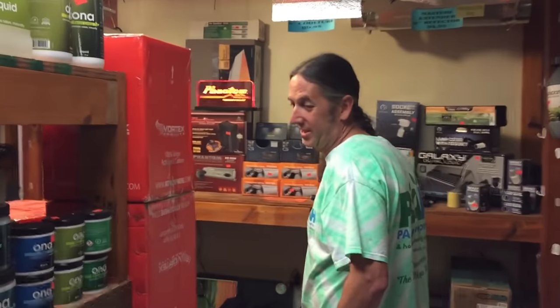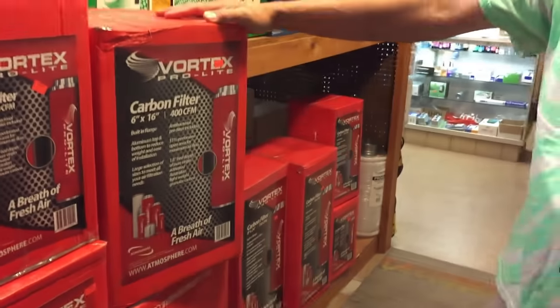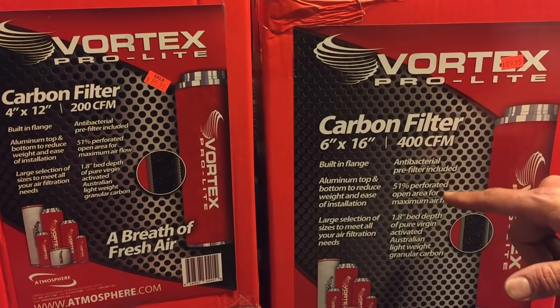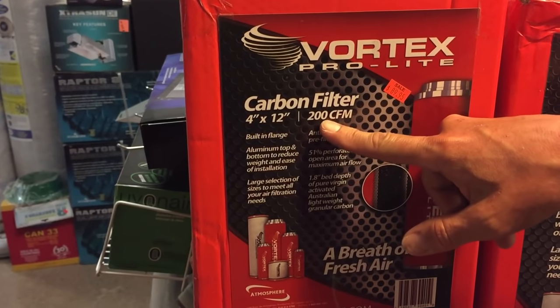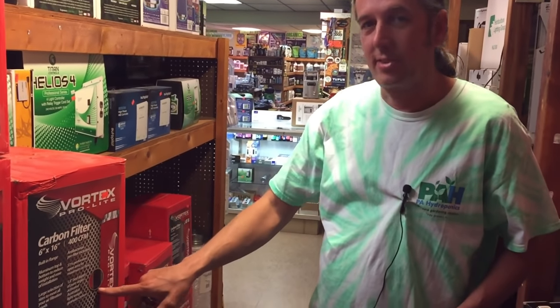As for filters, there are lots of brands of carbon filters out there. I've had some that didn't do a hundred percent of the job, and I've also had ones that do great and last a long time. The Vortex here is one of the newer ones to me — this is made by Atmosphere. They come in all different sizes. Usually you'll see six by its length; the six is your flange size, and that's going to have to match your fan. That's going to help match up your cubic feet per minute with your fan because the filters already know what's up. A four-inch filter handles 200 cubic feet per minute and most four-inch fans don't go over 200 CFM. If you used a 10-inch fan pulling 1,000 cubic feet per minute through a 400 CFM filter, the air is not going to have enough time to touch the carbon and it's not going to do the job. So it's important to match up your fan and your filter.